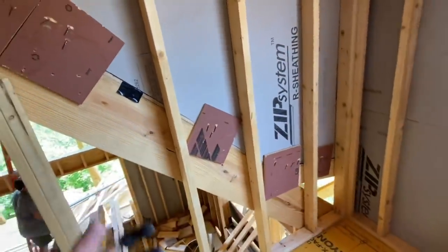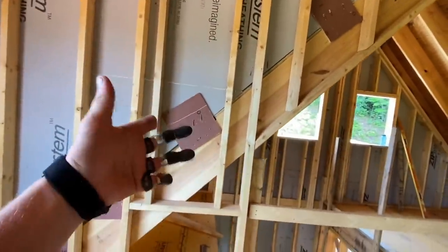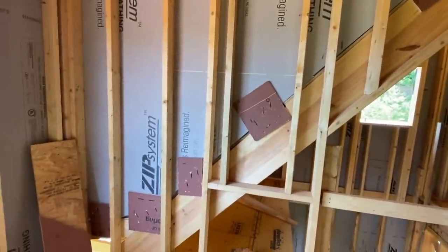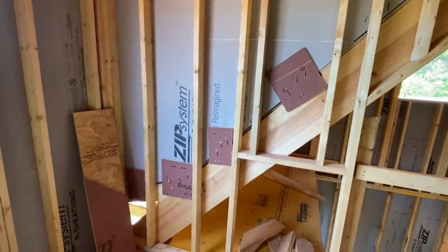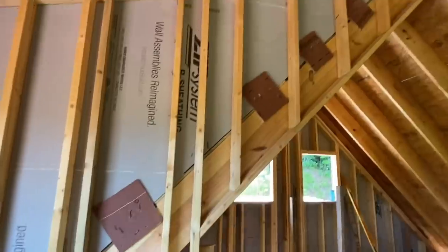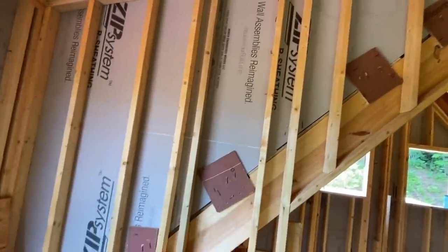And the reason we use plywood is because it's thin, and we're using high density R15 fiberglass insulation in these walls, and guess what? It doesn't compress much. And so when you put it over like a 2x4 blocking, which we do sometimes, it can actually push out a little bit and push a little bulge in the drywall. So we try to keep it nice and slim. And that blocking's not even necessary or required, but we just want to add a little something.